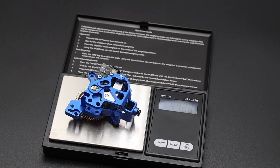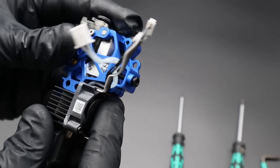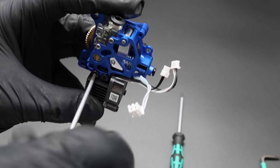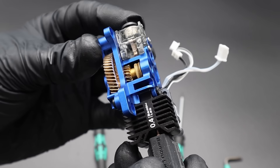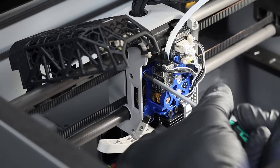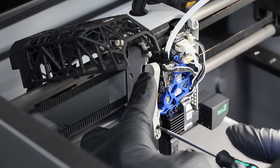Because of the larger brass gear, the upgraded assembly comes in at 51.76 grams — nearly nine grams heavier than the stock gear assembly. Overall with the entire kit the weight has increased by nearly three grams, so it's a bit of a wash, though you could argue the mass is more central than before. This is a pretty nice assembly, so let's get it reinstalled. I'll also recalibrate for vibration compensation because of the changes to the position of weight in the head.